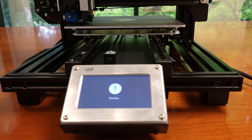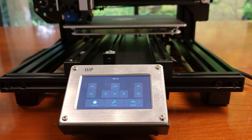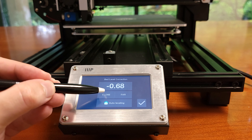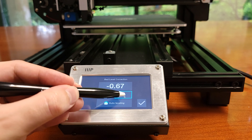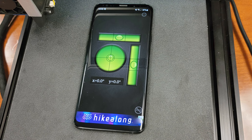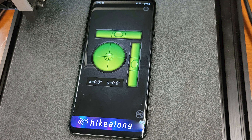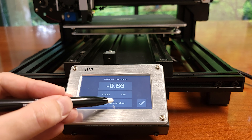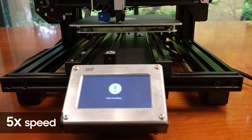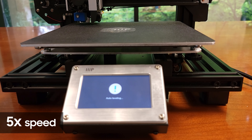What we weren't able to do on the V2 is what we find under the tune button. This screen helps us adjust the printhead to correct for the leveling of the bed. This doesn't mean you don't have to adjust the bed manually — there are still dials on each corner of the bed to make adjustments. But these are there to help level the bed and not necessarily to change the height of it like with the V2. All I did was install one of those bubble leveling apps on my phone, laid it on the bed and put the bubble dead center, then came back to this screen to hit the auto leveling button. The auto leveling process moves the printhead to certain spots on the bed and adjusts the height for any discrepancies automatically.